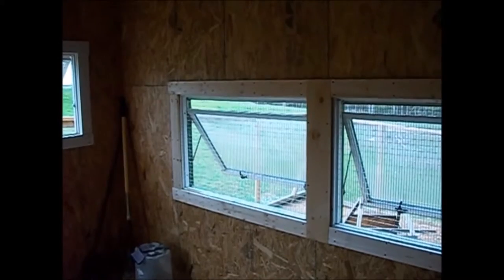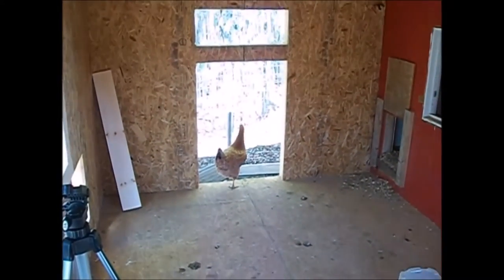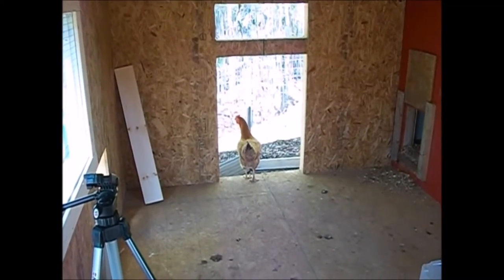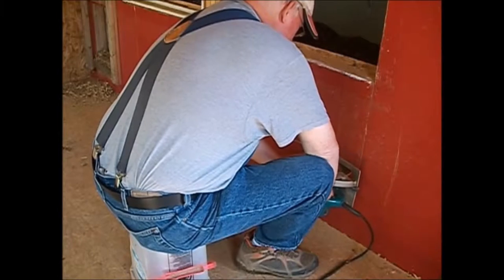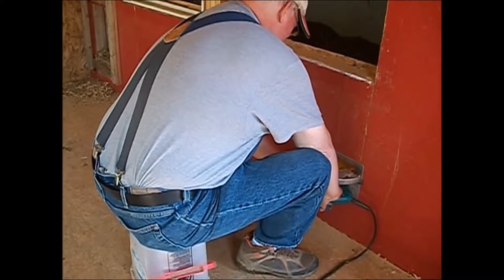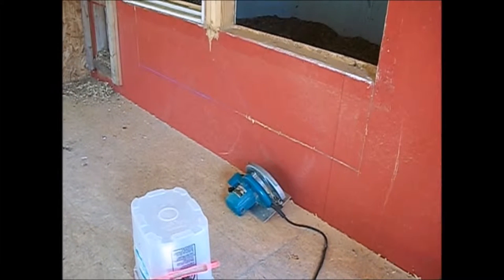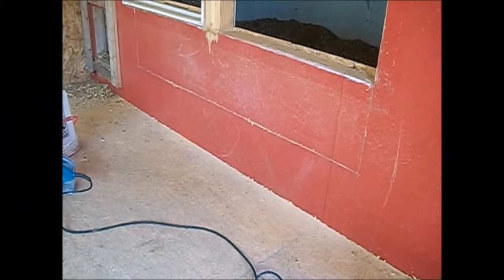Alright, time has come. As you can see, we got about halfway cut on that bottom piece. It's not the easiest going since we're cutting through nails, sheathing, and whatever else is in this path. I used the plunge cut technique to get through a lot of that stuff - it saves a lot of wobbling and banging around with a reciprocating saw compared to trying to cut it another way.